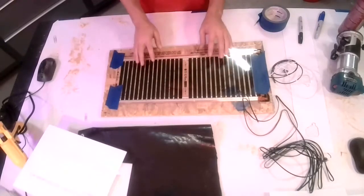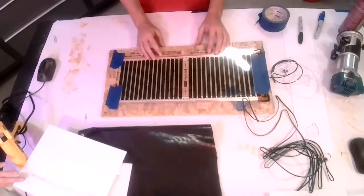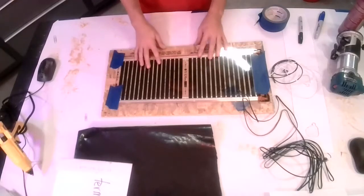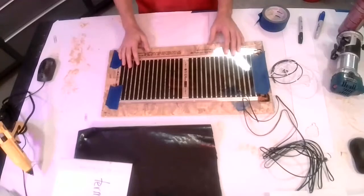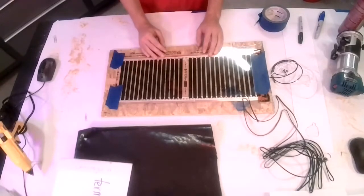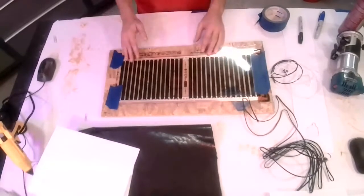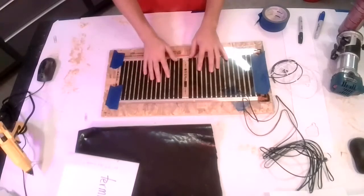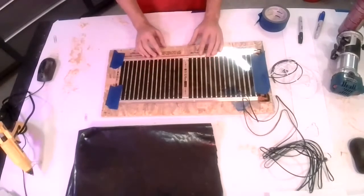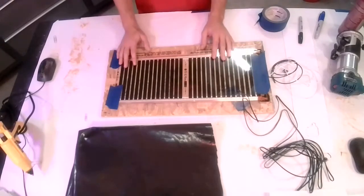Another question. How far do you keep the black gold away from your cabinets and fixed objects? This is true for gold heat too. It's not just for black gold. Generally, when we're laying it out from any toe kick or cabinet face, you want to pull back 2 or 3 inches. Especially on a vinyl floor, you're really not going to notice the heat difference, but it allows you to have room when laying out the mats, and you don't need the heat all the way up to the edge. But if you're doing the actual design stuff, reach out to us. We'll talk you through it. Also on our website, www.goldheat.com, there are the full installation manuals which cover how all that stuff works as well.